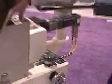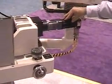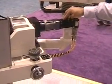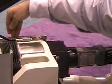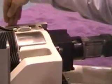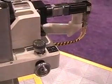The ram bed travels over frictionless cross roller ways, with a ball screw, gearbox, and servo motor. The servo motor has 4 millionths resolution. A glass scale linear encoder reports the ram position, also with 4 millionths resolution, allowing very accurate and repeatable size holding on an in-feed grind.